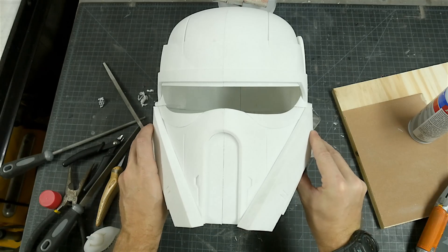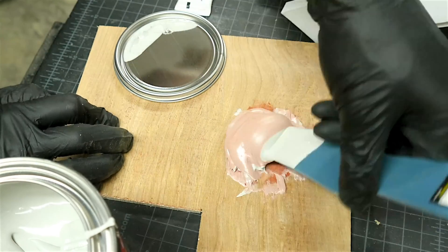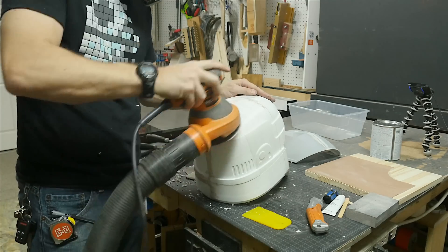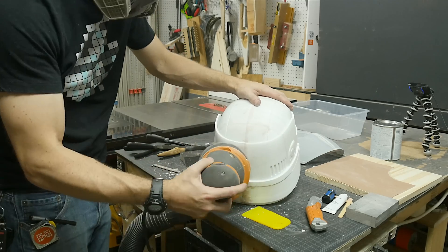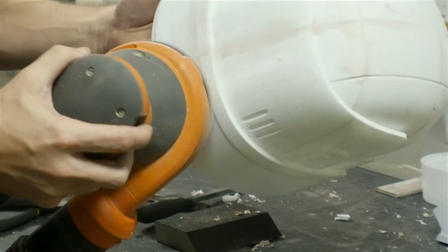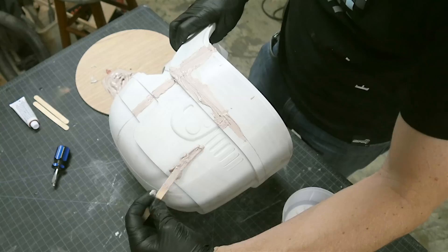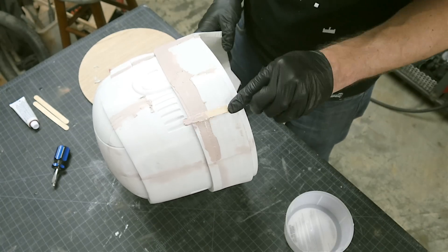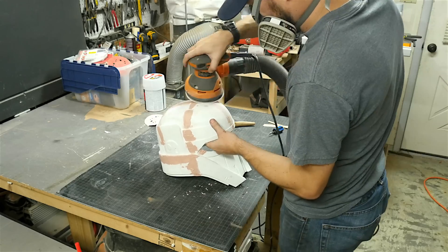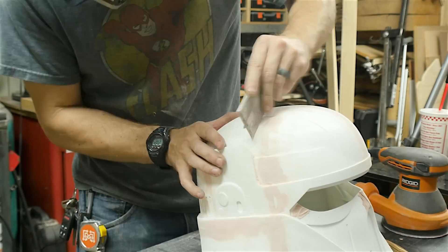Overall most of the seams turned out really nicely, but they weren't all perfectly flat. So to fill in the gaps I used some Bondo — a two-part mixture used to fill bodywork on cars. I mixed it a little wrong the first time and it set up too quickly, so I had to experiment with how much hardener to use. Eventually I got a good mixture and added it over all the seams, doing several coats — adding some, sanding it down flush, then adding more to completely hide all the connection points. I found that putting it on a little thicker and going back with a knife before it fully set made the sanding process easier. Make sure you wear a respirator when you do this because it's nasty and you don't need to breathe it.